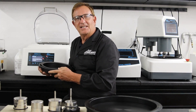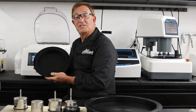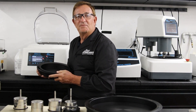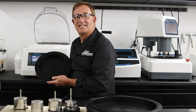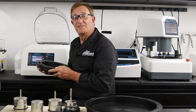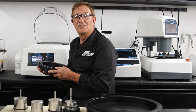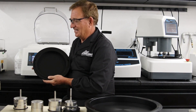These bowls are available in a POM plastic material or in an anodized aluminum material. Anodized aluminum transmits vibrational energy a little more efficiently than most plastics, but the advantage of plastic is that you can use more aggressive polishing compounds — such as even putting etchants in while you're polishing your samples. Those are the two types of bowls for the GIGA-S vibratory polisher.